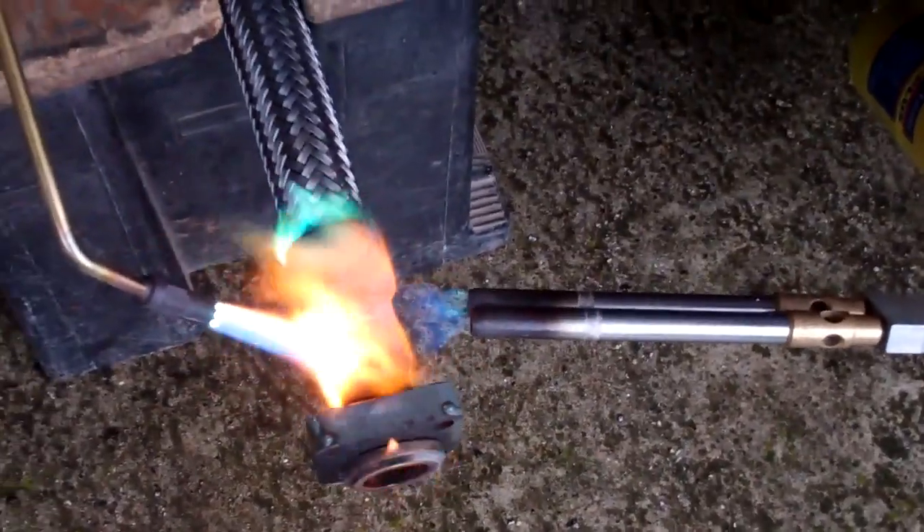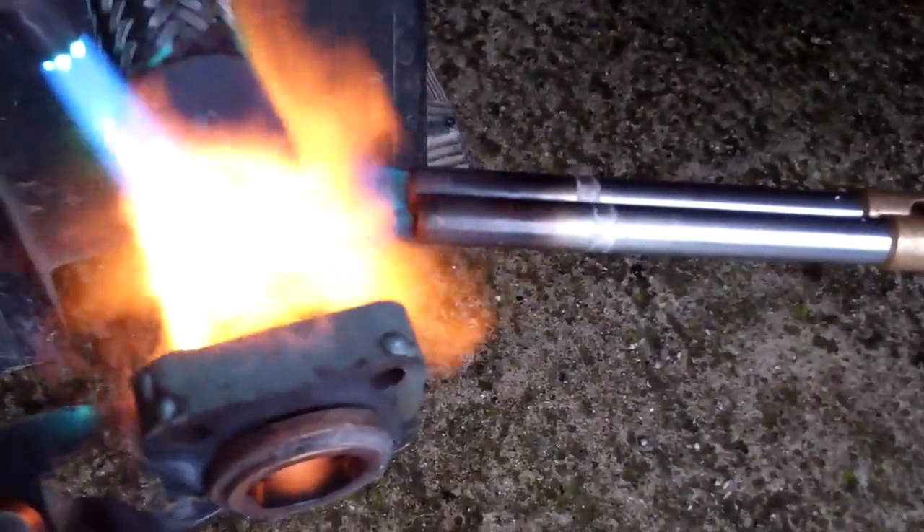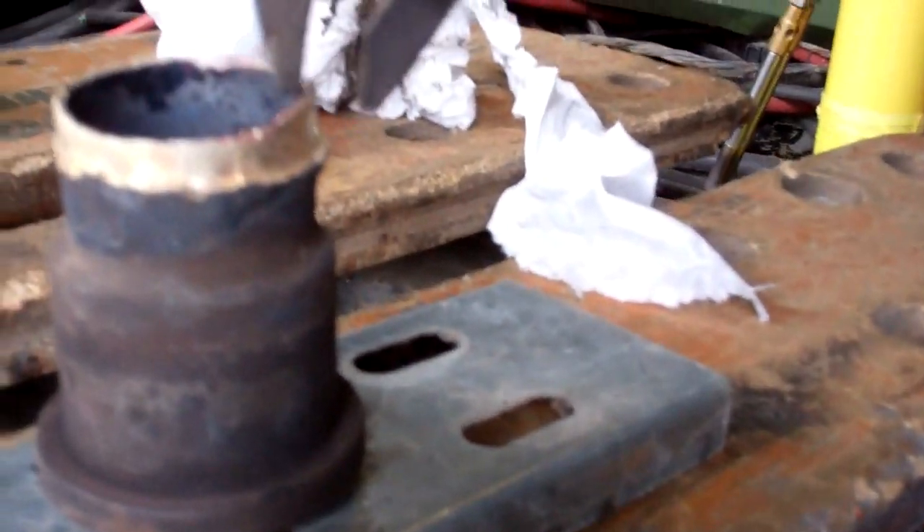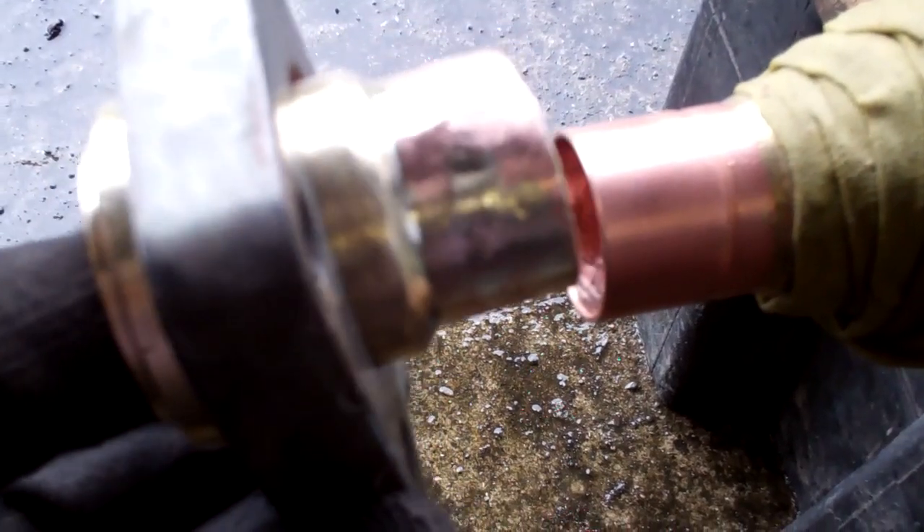It's getting ready for the grip. That's all that was holding that on there - it was about 4mm, which is a bit cramped for an inch and an eighth pipe. I've got that cleaned up. I've gone over it with a grinder with a sanding disc. Cleaned the braze down a bit so we can get it brazed in there a bit more.